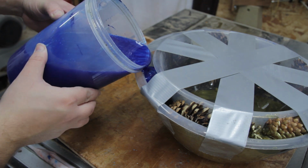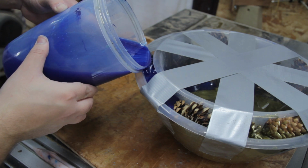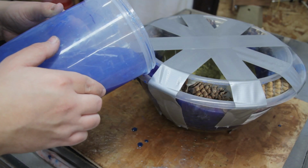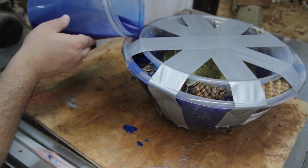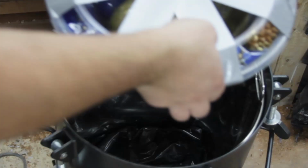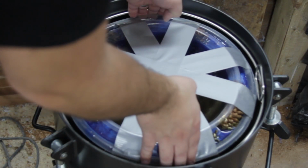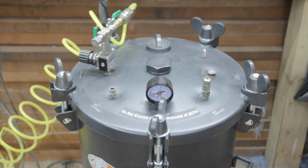There is another debate when you work with pine cones, whether you need to stabilize or not. Here I'm using some unstabilized pine cones. I just find the whole process of stabilizing wood very lengthy, and due to the amount of pine cones I needed in this project, I decided not to stabilize the wood. However, I put them in the oven for several hours just to make sure I have no moisture content in any of the pine cones.